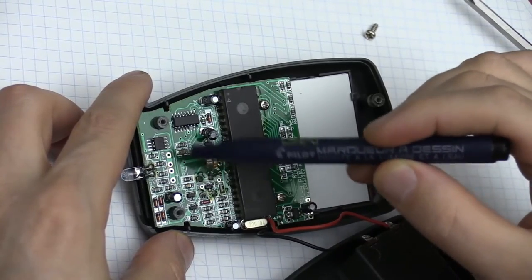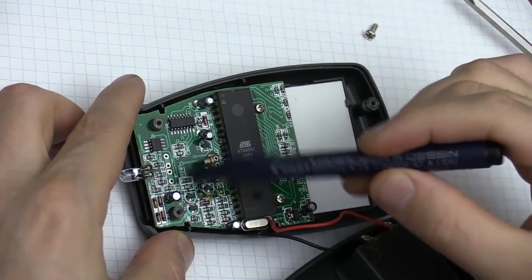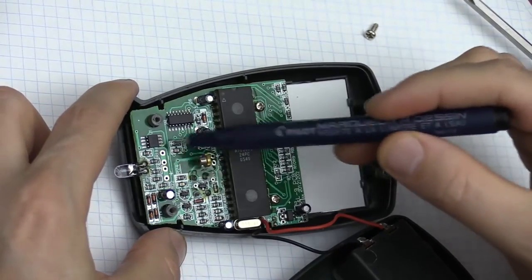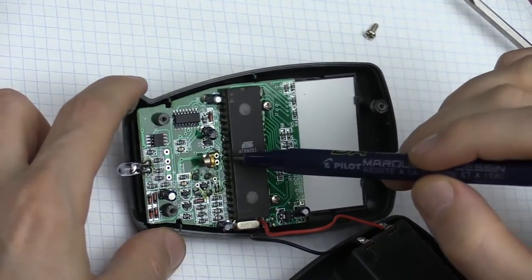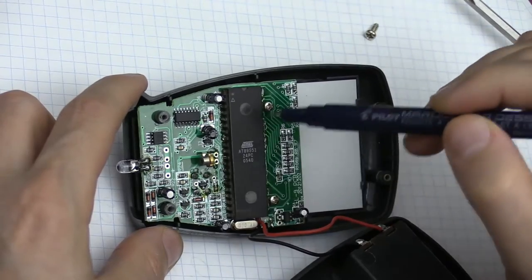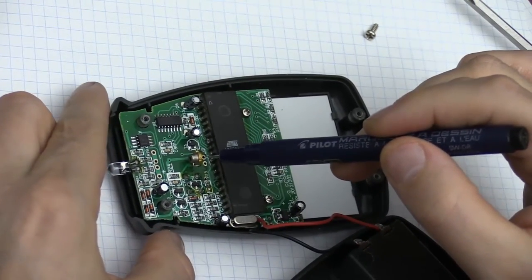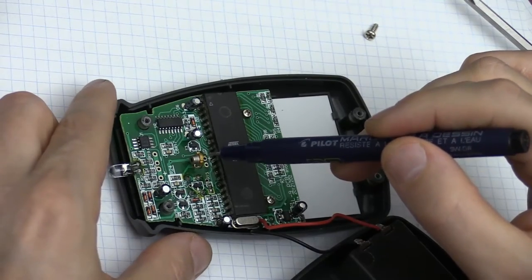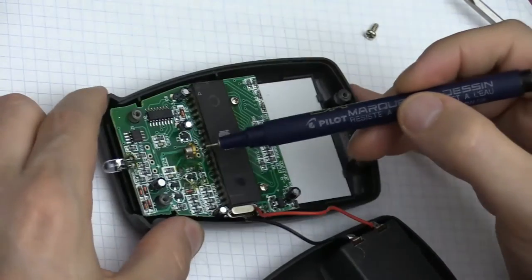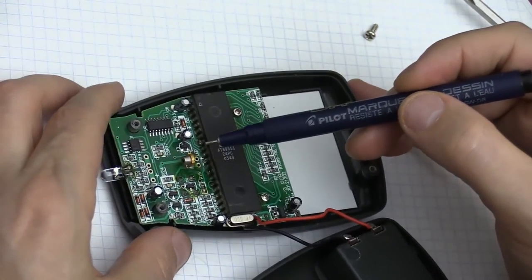You can see this PCB board is actually designed to take different versions of the component, probably due to the fact that they can't actually find the component. They always find different components to reuse, and then it can either be this. So there's a solder mask which says LED right here, and this is obviously not an LED. This is a small diode laser from some other device with one of its feet cut off.